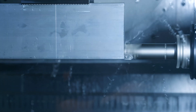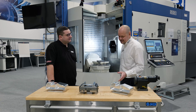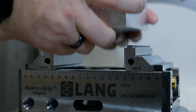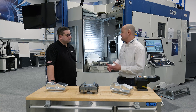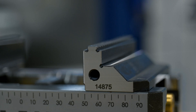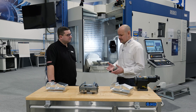You obviously do your stamping technology, which we didn't have today — so were you nervous at all about what we were doing without stamping the block first? Not at all, to be honest. This is aluminium, so the teeth on our vice will undoubtedly bite into that material. Stamping has a huge amount of benefits — not just for clamping the billet securely. It also reduces vibration, so with very large billets it stops the billet bouncing off the tool. With harder materials, it means you're able to clamp really safely and securely, and repeat the part into the vice within 10 microns every time. So if you have to take it to inspection and put it back in the vice, if you've pre-stamped it, it will repeat within 10 microns. Our vices have such good quality because we've been making them for so long — all the problems any manufacturer has in the early stages of their manufacturing journey have been ironed out. Really, it's just five-axis perfection.